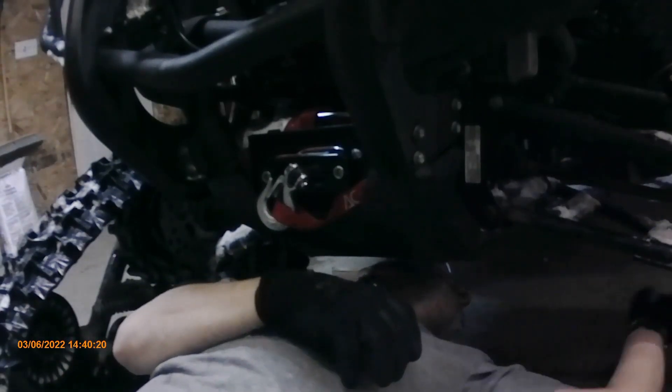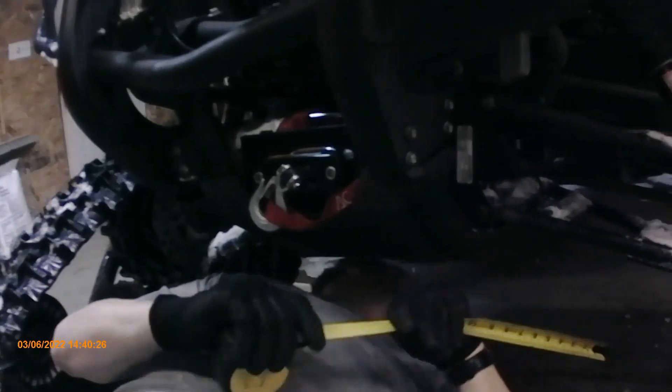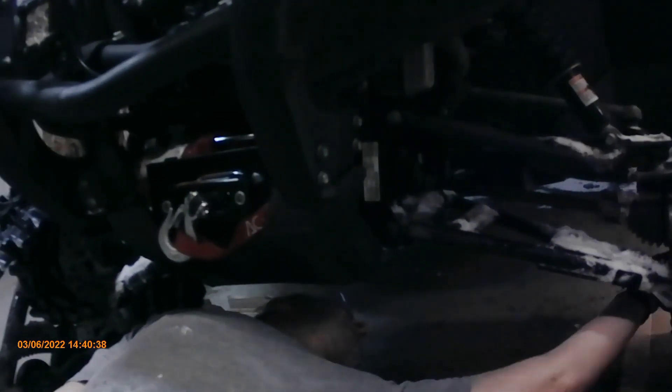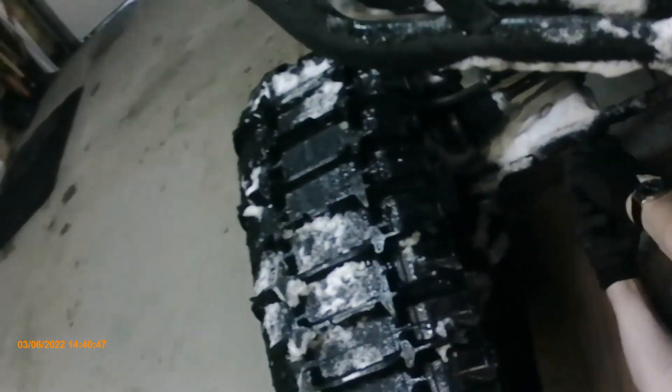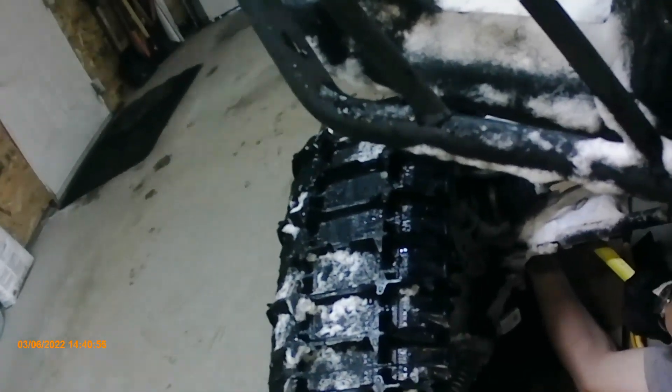We went for our one-mile, 1.6 kilometer jaunt and we're going to recheck the angle of attack. I'm re-measuring with the bar and I'm at 10 and a quarter — close enough. The other side, this is called the angle of attack. We've got 10 and a half, so we're going to have to adjust this one.